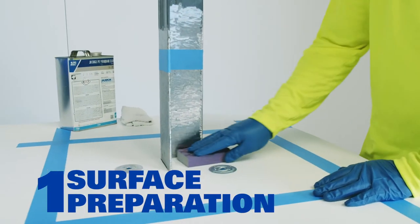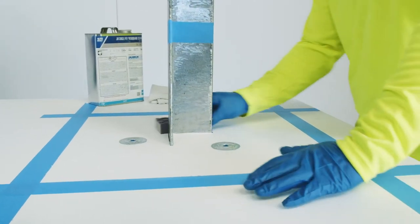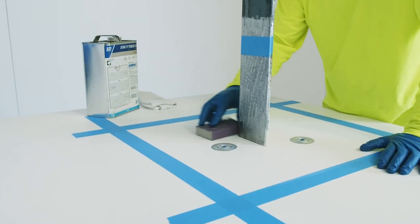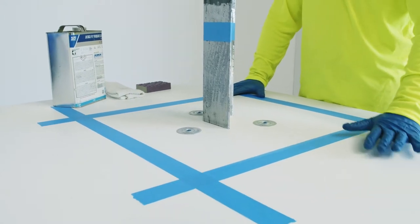The metal prep is done, so now I need to do some sanding on the membrane. The single-ply liquid flashing is also useful for low thresholds that you might come across on the roof after increasing insulation. You're probably going to run into some blocks, masonry walls, possibly some brick on some buildings, and possibly wood that has to do with low curbs or door thresholds. Are there different primers for the different substrates? Yes — we've got a wood and metal primer that we'll be using here today, a concrete and brick masonry primer, the thermoplastics share a TPO/PVC primer, and then EPDM has its own primer.